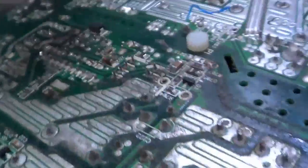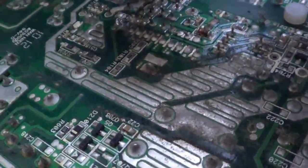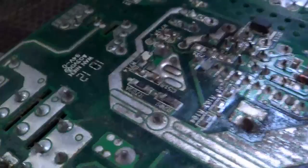Oh yes, look at that. You can't really see it from this angle, but if we check the electrical connections on the bottom, we can see all the dark spots are right around here or so. Careful, I don't want to short anything anymore. I might still get zapped by some of this stuff. Look at that, right there. See, there's the dark spots on the solder joints. You can see that roughly corresponds to the burn mark on the plastic.